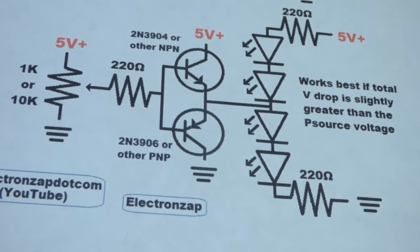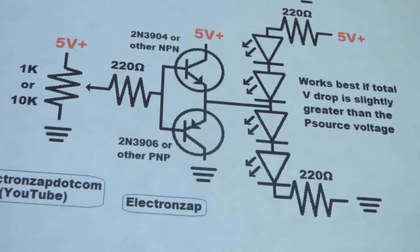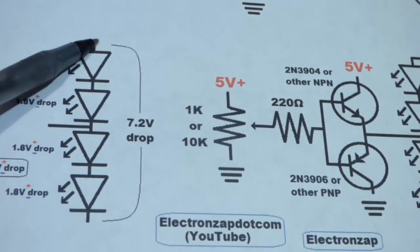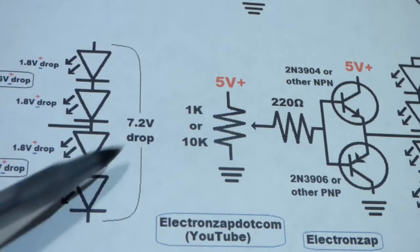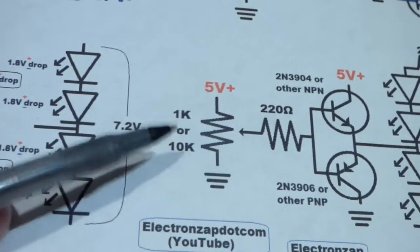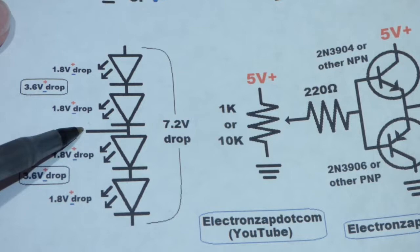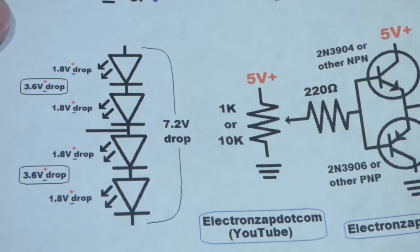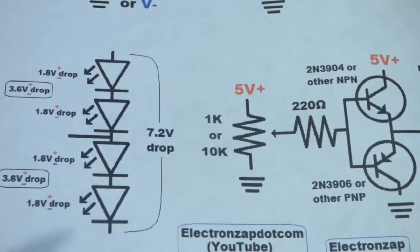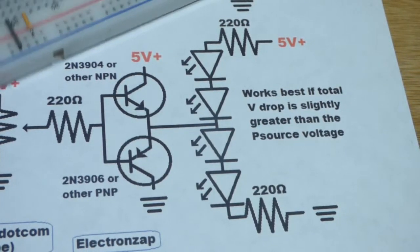Looking at the full schematic, we have our two transistors in push-pull connected to a trim pot. For the output, if we string the LEDs in series they would block more voltage than the power supply — each drops about 1.8V, so four would need 7.2V. Instead, we tap right in the middle, giving a 3.6V drop, leaving about 1.4V from the power supply to work with. The transistors connect the output directly to the power supply, controlled by the base, so we can turn on either one pair of LEDs or the other, but never both at the same time.